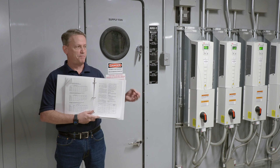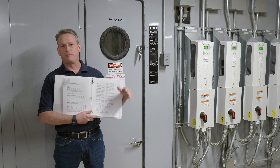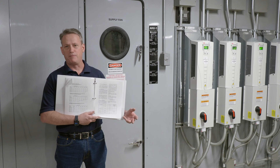That's basically the maintenance we have. Most of the controls are being done by others. There are dampers within the unit, and those dampers are being controlled by your building management system. The speed of the motors themselves is also being controlled through your building management system.